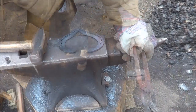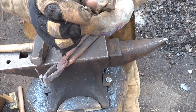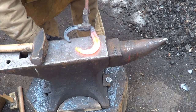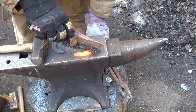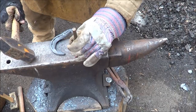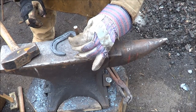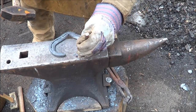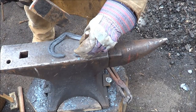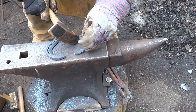I'm gonna start putting in the details for the head — nose, ears, and mane. I use two punches: a plain flat chisel with a nice clean edge, and a small punch. Sometimes I use an eye punch but today we'll just do two simple punches. I'm going for the placement of the nose and eye first, just to tell me where the rest should be. I'm going to cut the ear coming from the head out to the edge, then do the mane going back — just go back down through, keeping the piece flat.